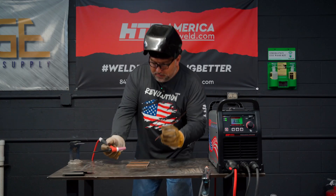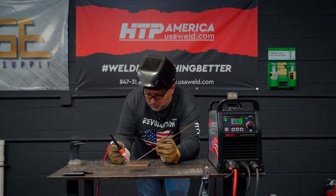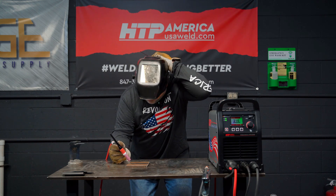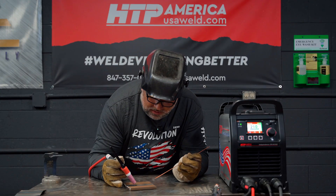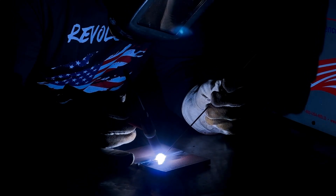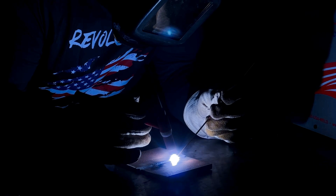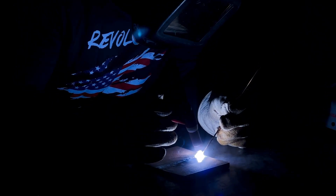This feature is very handy if you're up on a ladder and need to weld something with no way to operate the foot pedal. You don't have to scrape this over at 200 amps, get stuck to it while it's hot. It's very easy — lift it, set it down, lift it up, the arc ignites and you weld. I touch it to the metal and the moment I lift off, that's when it ignites the arc. To terminate, I draw a really long arc, hold it for a second, and then it tapers down and turns off.